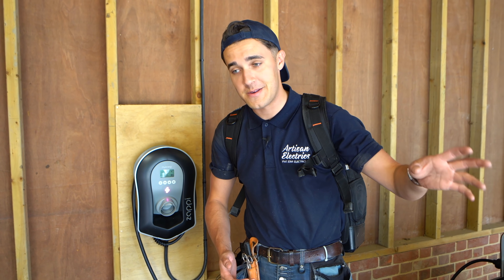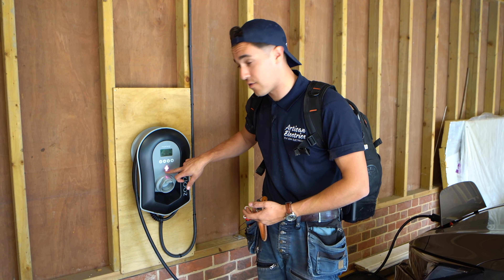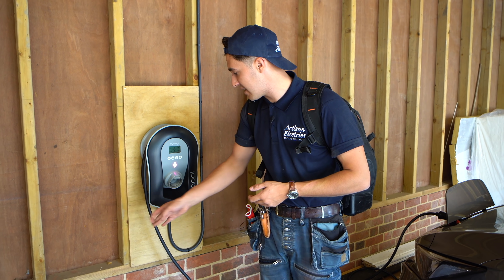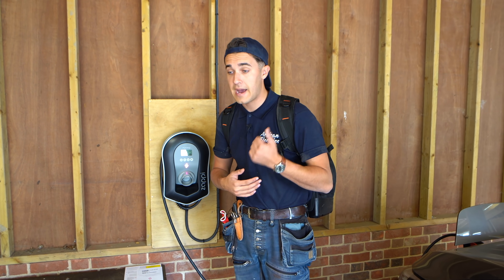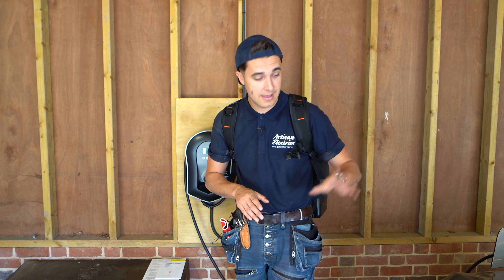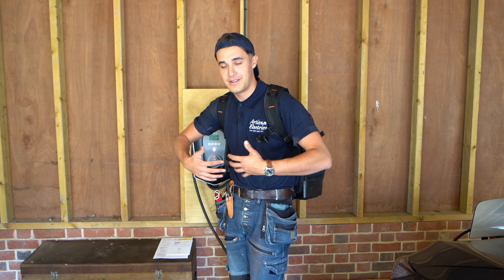Right, so that is the job finished. I've just gone back and double checked all of the main fuse sizes, checked the earthing system, because that's actually a sub-main that board connected onto. What I've done is connected this up with a grid limit to just below the maximum rating of the breaker — the sub-main is a 63 amp breaker so I've set a 60 amp grid limit on this. Realistically with everything pulling at the minute in there, it was only pulling a few hundred watts so I'm not really worried about it getting close to that. The patch cable — I've extended the patch lead for the hub so that's nice and neat now. The customer's really happy, car's charging — happy days. Thank you very much guys for tuning in, I hope you enjoyed it, I managed to learn something and I'll see you on the next one.